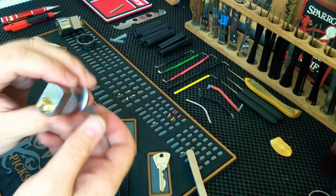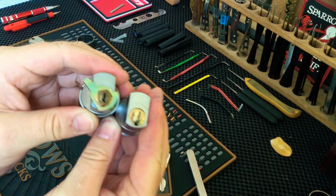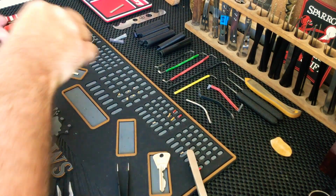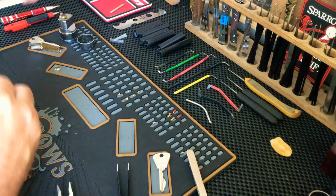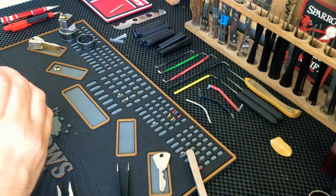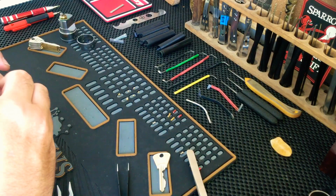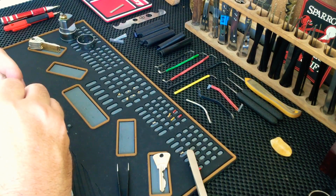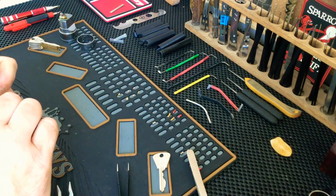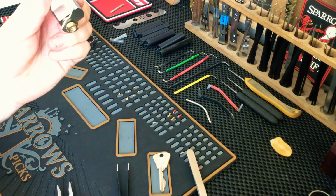And yeah, I've polished that up. I've polished up the rear as well. So usually the rear looks like that. Yeah. So I've just done a bit of work with elbow grease. Just hand polished it. Also hand polished this bit as well. So I've just checked the orientation of this tailpiece, which is this way, I think. And these are a bit hard to get on. And so are these nuts. I've polished the nut as well, so to make them look really, really nice. And you do need to vise these up and use an 11mm spanner to get it on properly, and be very, very careful not to cross thread it. So yes, there is the VingCard build done.